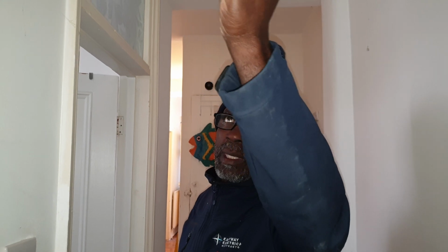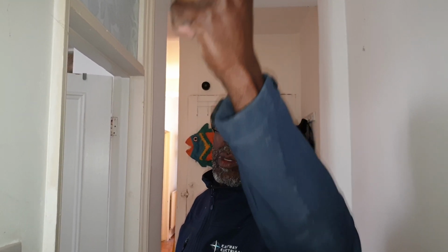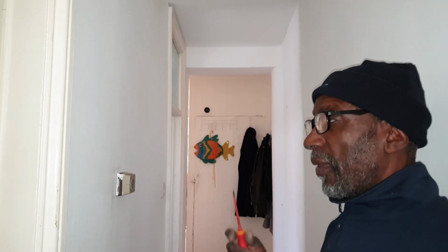And you can't just have a switch line up there because it's got a smoke detector. So you must have a live and a neutral up there. So they've wired it all different sorts of ways. See, to solve this problem, because I could be all day, I'm going to have to get the old megger or bell and bell out how the circuit goes. Because once you know how the circuit goes, then you'll probably come across what's causing it.